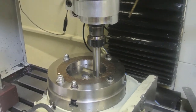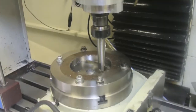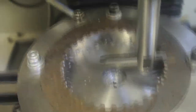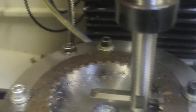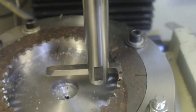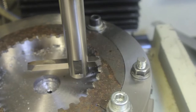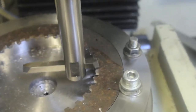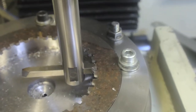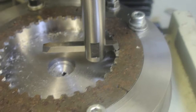Hopefully, you know, it's only a thousandth of an inch at a time but it's fairly close. We're pretty much there with this one — it's cleaning up the teeth profiles really nicely. You can see the cuttings underneath. It's doing two passes at a thousandth of an inch, and sometimes it's squeaking on the second pass, which indicates it's taking a thou cut quite easily on the first pass and not leaving much to cut on the second — which is good. We're not far off now, maybe another five times around.